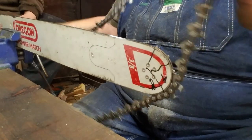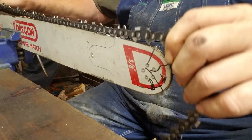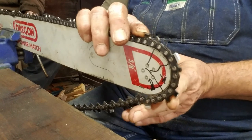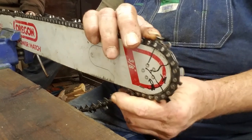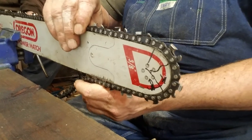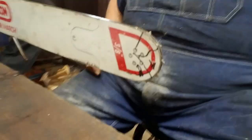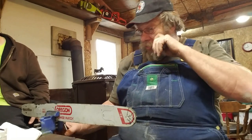Now let me show you something. Boy, I told you this is opening a can of worms. Okay, I know you guys can't do that, some of you. Get a chain tangled up, go flip, flip, flip. Okay, look at this. Got one right here. You got one right here. And you got one right here. You got three teeth working together instead of two. This one has less kickback because of that. I'm just making you aware of things I know. And as you see that go around, you see three teeth working at it until it gets to straight again, all the way around. So be aware when you're running full skip, what you're dealing with. I'm going to get you all wonky here and at a weird angle. I don't care because it's just one of them days.